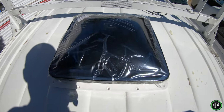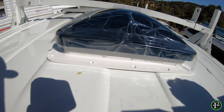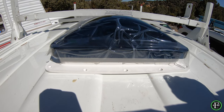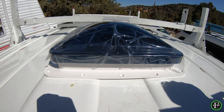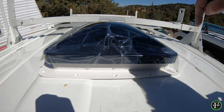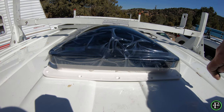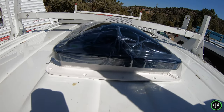Now I've just set it in, so next I'll line the edges of the top with butyl tape — it's an RV staple tape. You can go to any RV store and get it, or probably on Amazon as well. Then we'll pre-drill four holes, get four screws in, then pre-drill the rest and send all the screws in. You could add some additional silicone if you want, but that tape usually works out pretty good.